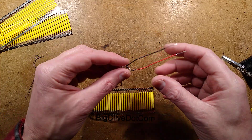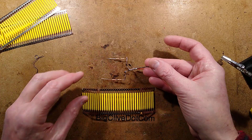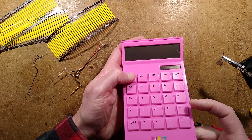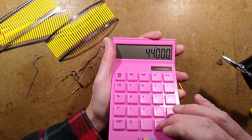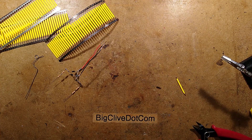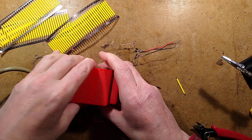Here is my ugly creation. It's got two resistors in each leg — 22K, red-red-orange — the discrete bridge rectifier, and a couple of wires. Technically speaking, because I've got these current limiting resistors, what sort of shock would I get if I contacted the live side while grounded? Worst case: 240 minus about 40 volts drop across the filament, so 200 divided by 44K — about 4.5 milliamps. That's not life-threatening, but it would definitely hurt. And safety is important, said Clive, just bringing out a complete mess of electrical stuff onto his bench about to operate at 240 volts.